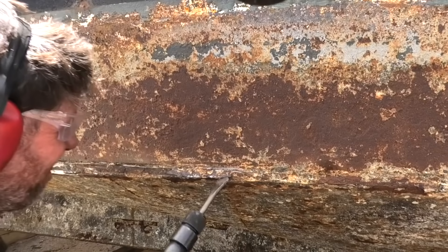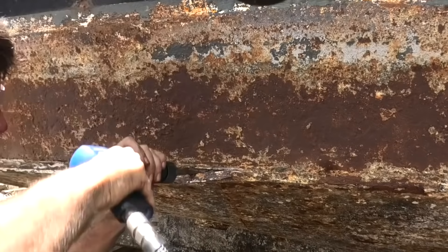On the bright side though with this leaking fuel, I did hit on a bit of a technique that works pretty well and is reasonably quick, which is doing shallower cuts with the angle grinder and then getting in behind the strip with the air chisel. That meant that I didn't have to cut as deep and risk cutting through the hull, and I could still get it off pretty quickly without putting too much effort in. I'm pretty happy with this technique and I now have all of the rubbing strip off below the doublers. The only remaining bit is the little bit on the bow forward of the doublers. Next thing I'm going to do is just take the awning off so we can get the crane in.